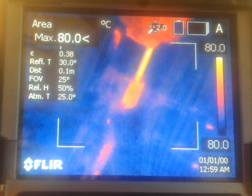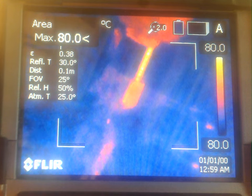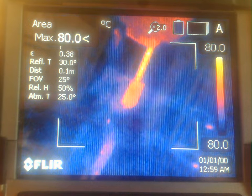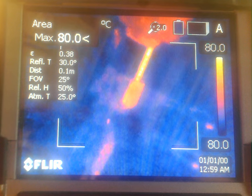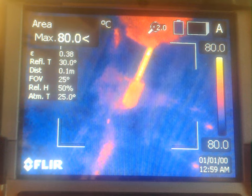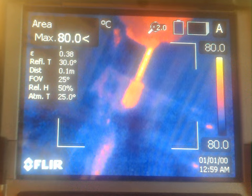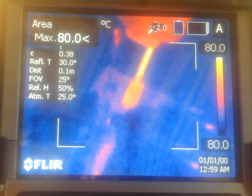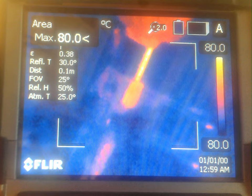This is test number one: 1.6 millimeter copper wire being deposited on aluminum nitride — medium polished aluminum nitride, 99% — at 15 millimeters per minute surface speed, 30,000 RPM, and a total XZ feed ratio of 80, which means 10 millimeters of surface speed distance per 0.125 millimeters of Z feed. I'm going to turn the spindle on at 30,000 RPM and start the deposition.